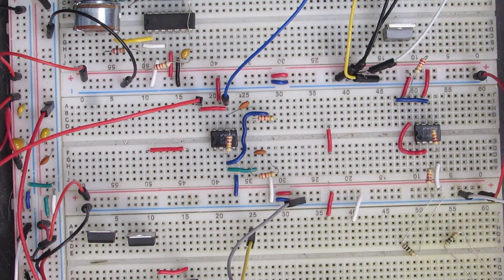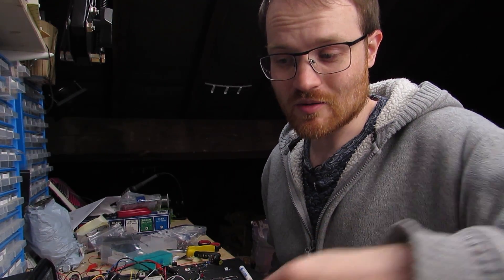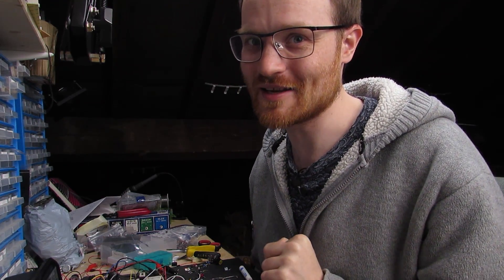I've got a 20k resistor here and if I put a 10k resistor down to ground. Looking at the oscilloscope we can see we're getting no oscillation. Have I done something wrong? Well, I've actually been a little bit sneaky - I didn't mention how to get the oscillations to ramp up in the first place. We're feeding back the noise and selecting that one specific frequency, but we need to actually amplify that frequency first to get the oscillations going. Essentially we need the circuit to make the gain greater than one and then, as soon as the oscillations have ramped up, throttle back the gain to an overall gain of one.